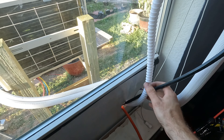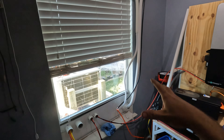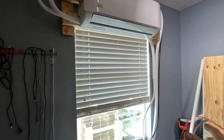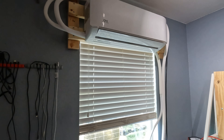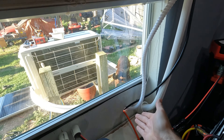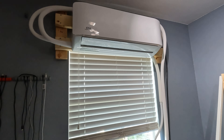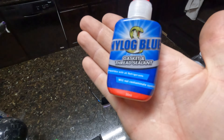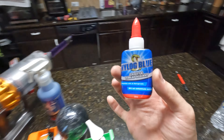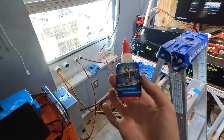We have our power to the outside unit and the drain hose run. I'm going to leave it like this for now and tidy everything up once I'm done, just for the purposes of showing the most important steps. Now we're going to torque the fittings on the inside and outside unit. I'm also going to use this sealant — you put it on the ends of the flares to help create a better seal. It's not 100% required but I would recommend it — it just increases your chances of not having a leak.